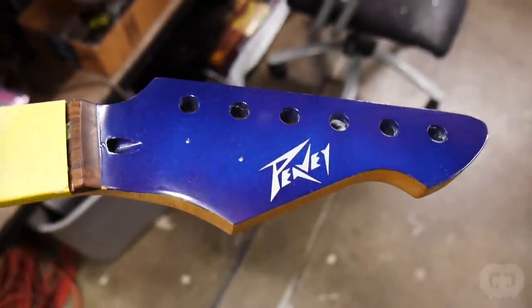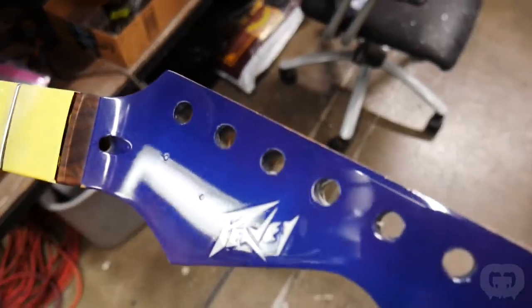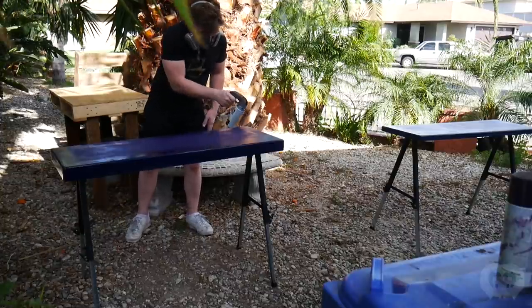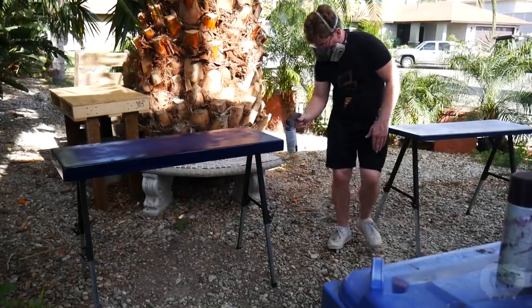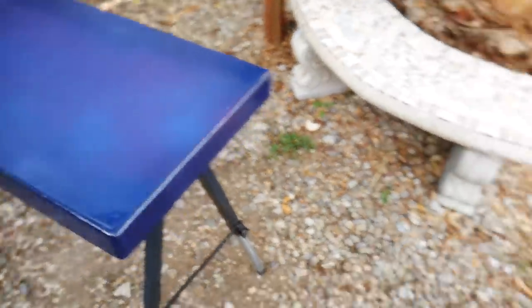You also need to make sure you've laid on enough clear coat so you don't burn through to the next layer down when sanding. I'm also building a custom case to go with this guitar — I usually have a few different shells and sizes ready to paint, built by my shop assistant Ryan. I like to color-match the cases to the guitars. I'll also be clear coating this one, and after the clear coat it's going to look crazy.